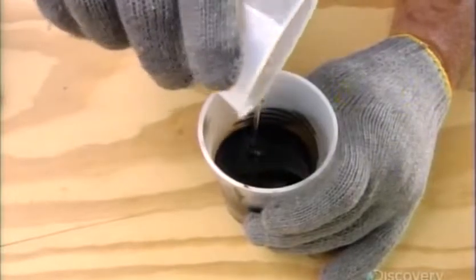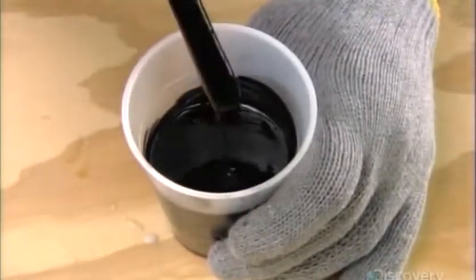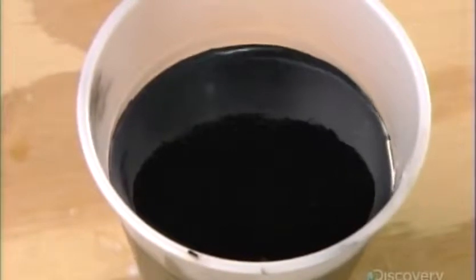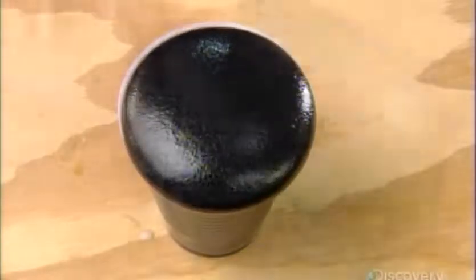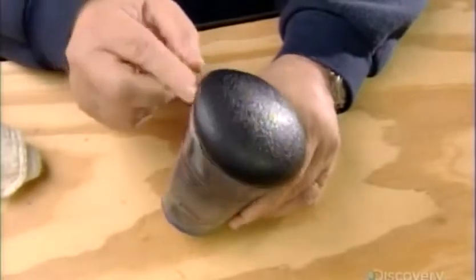This demonstration shows the basis of the next step. When mixed together, these two polyurethane chemicals react to each other and produce an expanding foam. By guiding this expansion within the confines of a mold, one can make this dense foam assume a specific shape, such as that of a steering wheel. The process is called reaction injection molding.